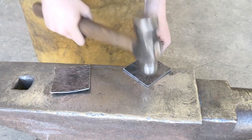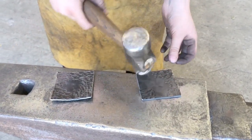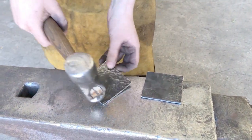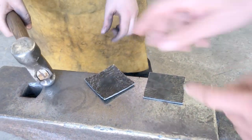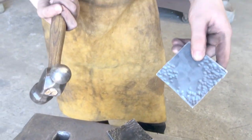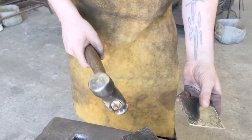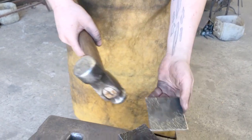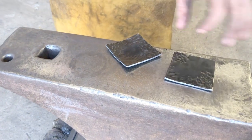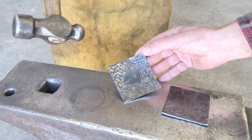So Harvey, tell me what you're doing here. I'm texturing the bottom plate for the candlesticks — just taking a hammer and bashing around the centre area here. So you're using that side of the hammer — a ball-peen — to get a nice dip shape into it. I'll do that all the way around, missing out the middle, so one of my colleagues later can weld the candlestick holders that they've been twisting. And then that'll be the completed product. Look at that — beautiful.